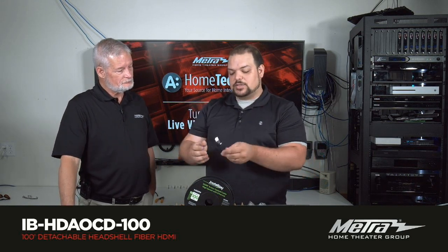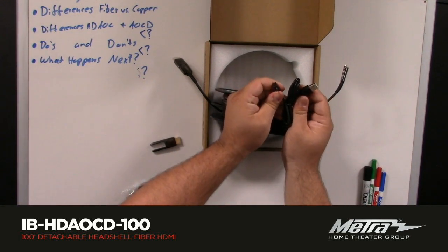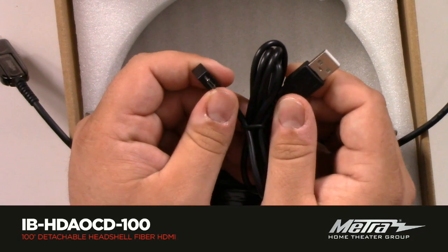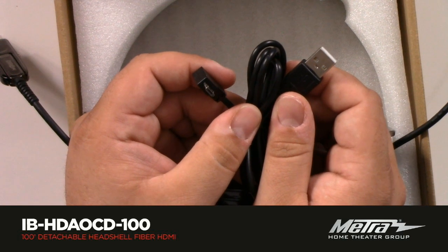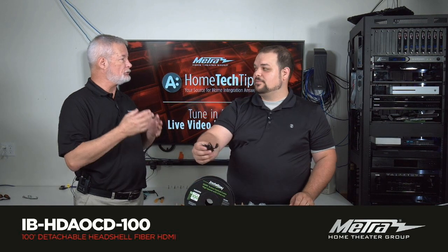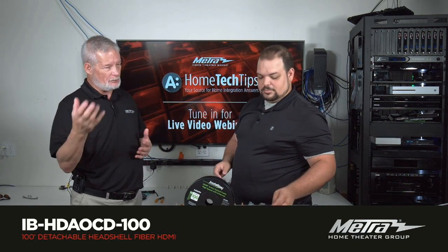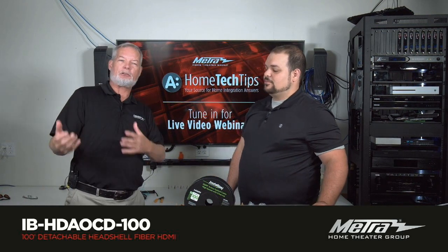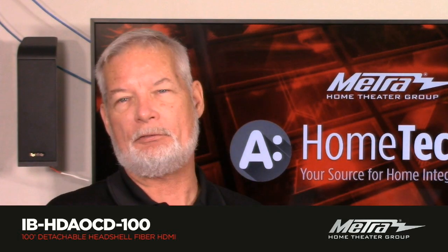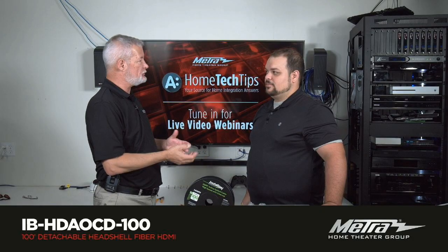Now, what else comes with this is a small USB to micro USB cable. This is a powered cable, but it is powered off the HDMI bus. What is this for? We have actually run into a few cases, and this goes back to the old days of AOCs, where some of the displays and sources do not have enough current to make each other happy. Correct. The way HDMI works is a display side device is responsible for sending current backwards to the source to power it up. This is not always enough. So with this cable, you can add the supplemental current to make sure that everybody's happy.